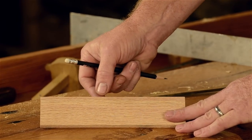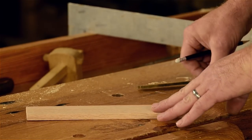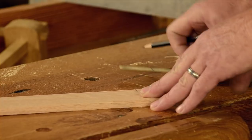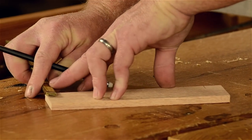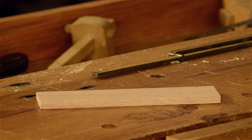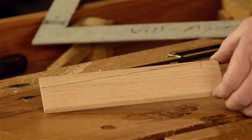The thickness of this piece is about three-eighths. Whatever mortise chisel you're using is kind of what determines this — three-eighths, or a little thicker, or whatever will be fine. To start out, measure seven-eighths in from one corner — the side you want to be tapered — and make a simple little mark. Go to the opposite corner and measure down five-eighths. Now we've got two little pencil marks. Take your framing square, or straight edge, or whatever you have handy, and line it up to those two marks and just connect them. That'll give us that angle.